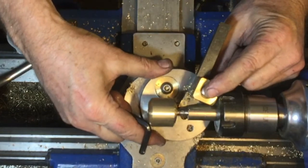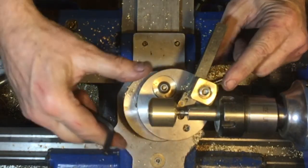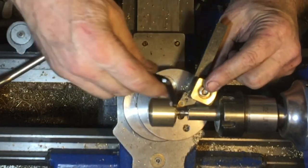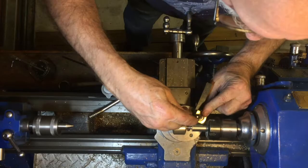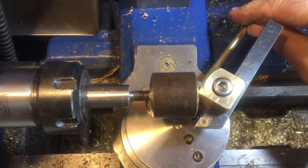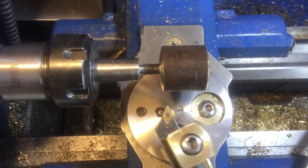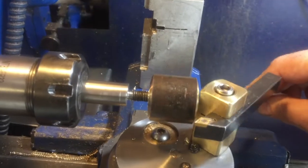The main way is the movement of the top disc. You can see that the top disc is rotating on the one below it, and that is the main way for making fine adjustments to the radius of curvature. You can actually see in this video that the top disc is slightly off-center to produce the required radius.